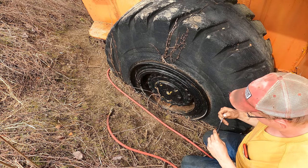And then, from there, we went to a leaking transmission line back here. That guy right there is pouring transmission fluid. And I even looked earlier for leaks when I filled up the transmission. Made sure it was topped off and it was not leaking. I didn't see anything. I throw it in reverse now, it leaks.